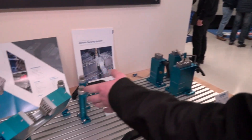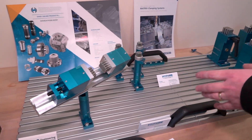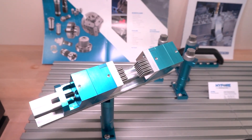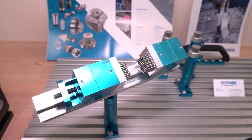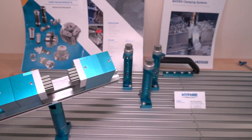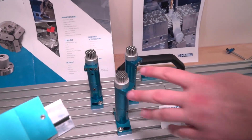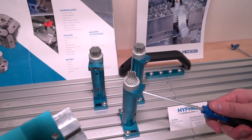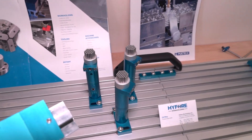You'll just be touching down, so it doesn't require any specific holding force — nowhere near as much as on the machine. And these here are a similar principle but just different styles of ways of holding the part. They all work in the exact same way — the principle is the same, they're still spring-loaded, and they all work with a simple 5mm allen key. You can see they're locked through the pin fields and then you release the pin field for the component.